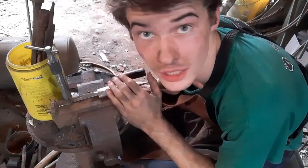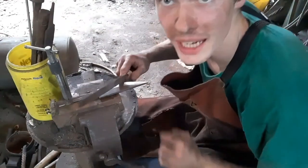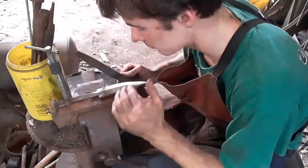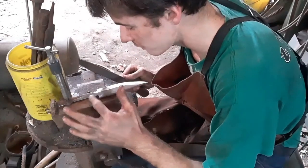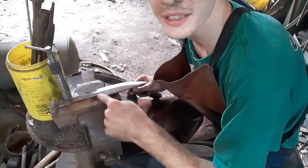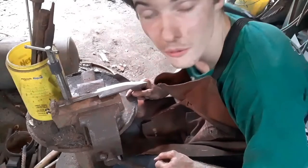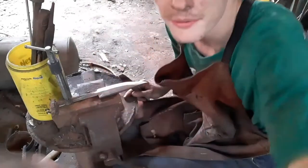Okay, I got the bevels all ground down with the angle grinder, so what I'm doing now is I got a file. I'm coming back and I am draw filing across the blade and filing at angles, just trying to make sure that these are perfectly flat before we start hitting the belt grinder. Just get everything nice and square, make everything a little bit easier. And before we go to the belt grinder, I'm going to use the files to come in here and clean up this little notch where the brass is going to slide down, make sure it's all one even width, and a nice table going all the way down. There ain't no high rises that's going to mess us up on trying to mount the brass. So after I get through doing this on both sides, then we're going to go to the belt grinder.